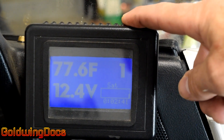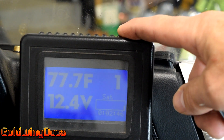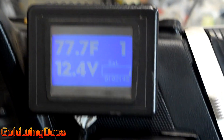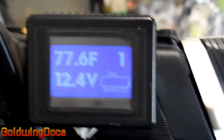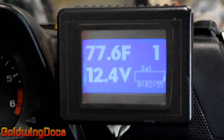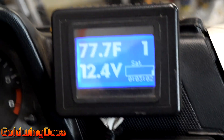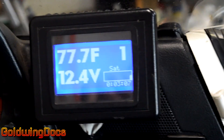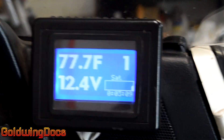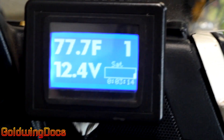It's barely visible in this light in here, but at nighttime, that's about the brightness you want. If I take my finger off, it's going to start brightening back up again. So, it does that automatically — you don't ever have to change the brightness of the screen. That's all done in code that measures the light and averages it over time to adjust the brightness.